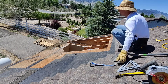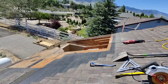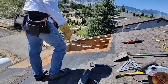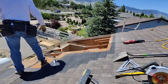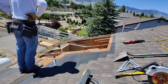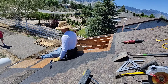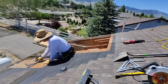Up and down the ladder all day long. I don't know how many steps I got in during this whole project, and how many times I squatted down and got back up. After three days of continually doing this, my knees were hurting so badly. So this is the first piece — now I have to get the saw out and cut away a little bit more, because you want the plywood to end right in the middle of a 2x4 truss so that both pieces that meet there are supported by the 2x4.